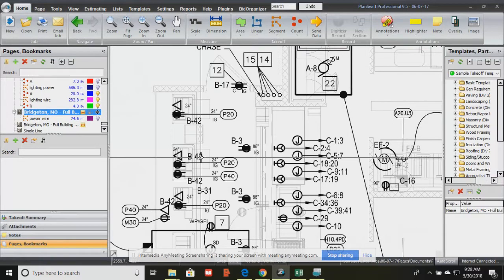So it looks like in their kitchen area, somehow they have some kind of communication going on with maybe the exhaust hood, or who knows, ordering or something like that. The menu might come through there. So that's why we have those white triangles, because the white triangles represent data and telecommunications, as opposed to a telephone, which would be black.